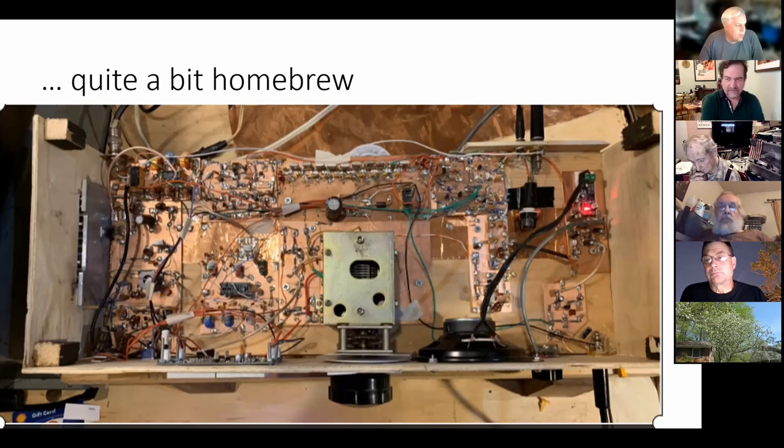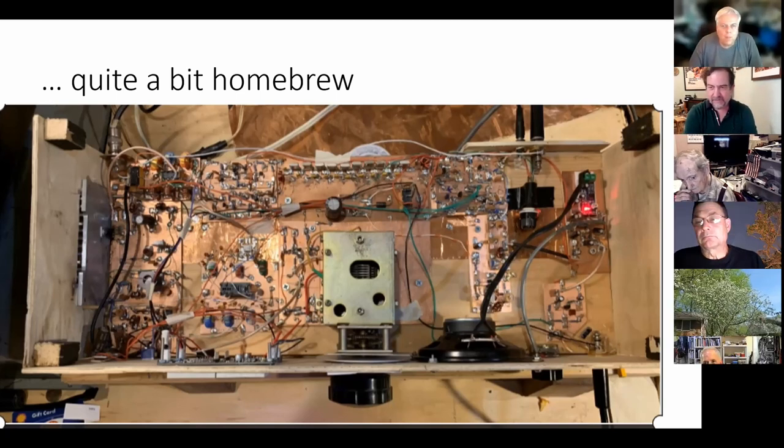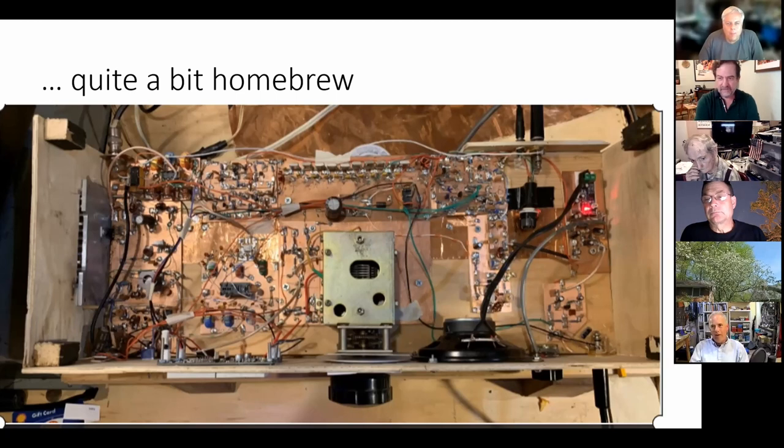And a lot of people complain about the LM386. I think it produces superb, high quality, high volume. I got more audio than I need. There's so much audio gain in this thing that I don't really have to worry too much about IF gain or insertion loss in the filter, because you only need about 100, 110 dB from the antenna to the speaker. And I got more than enough. I'm running this with the volume control nowhere near the top. So I think it's fine.